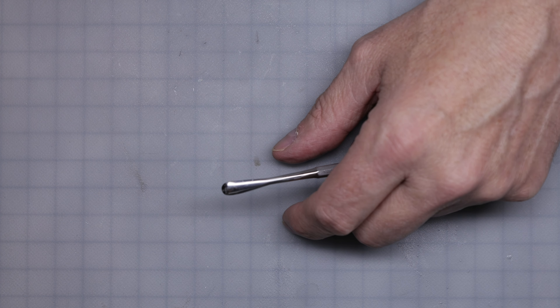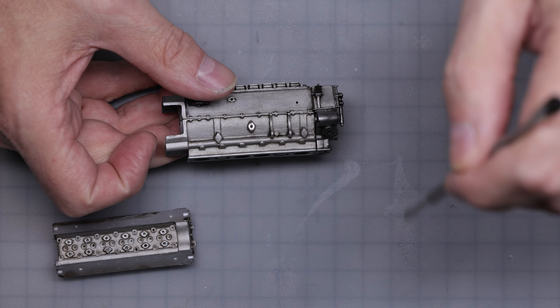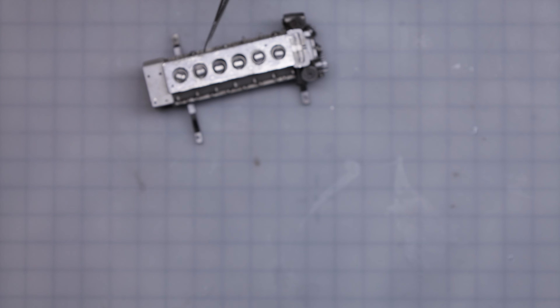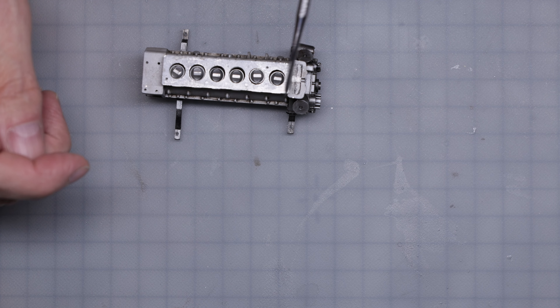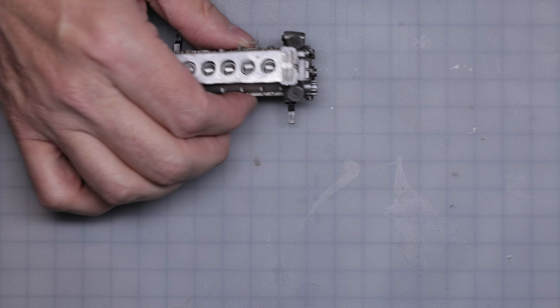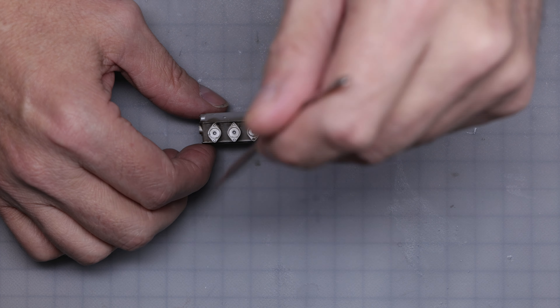So the head will go on. Interestingly, this surface here is warped — this whole block is a banana, it's warped. This wasn't bad — it had all the dowels cast into it that align with the holes in the head. So I ended up having to cut all those off and filed this. I didn't get it completely flat because I'd have to take out too much material, so I got it really close. It's just touching on the edges, a bit dished too, but I got it flat enough. But then this piece was also warped the same way, so you combine the two warpages and you have this massive gap in the middle.